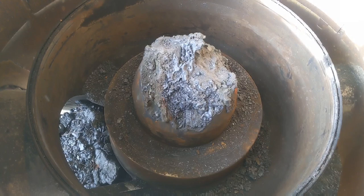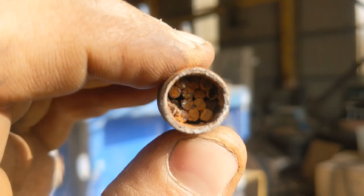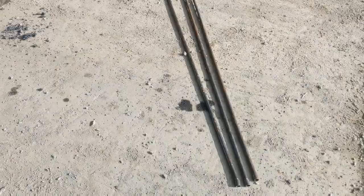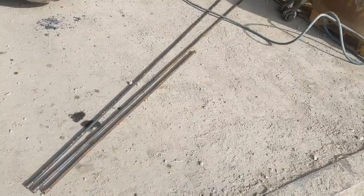So incredibly, that's the entire cutting process. The oxygen flows down through this rod, which is packed with little iron rods around, and that lets the oxygen flow down the gaps. So that is essentially the diameter of your cutting nozzle and the size of the oxygen flow that flows down the rod. The rods are 3 meters long, and they're used for heavy scrap processing, cutting extremely thick material. The only limiting factor to how thick a material you can cut is basically your oxygen flow and pressure. In this case, we have a large bank of 15 bottles.